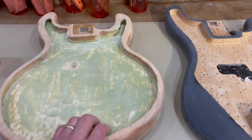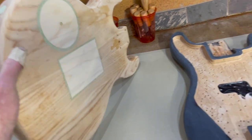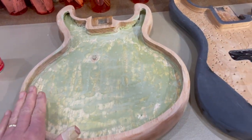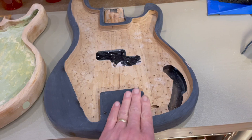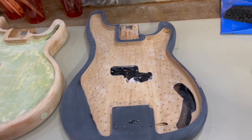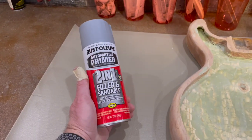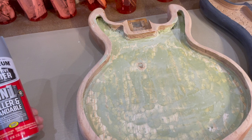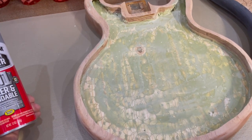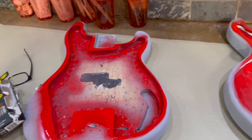After quite a bit of Bondo wood filler, I managed to fix the guitar body — filling spaces, old cavities, and gaps, then sanding it down pretty well and repairing nicks from the router. For the bass, I just sanded the body down to take the shine off so it'll take primer well. The next step is a Rust-Oleum sandable automotive primer on the bodies, mainly the backs, before I think about doing any epoxy. I also shot a bit of red spray paint under the ledge of the insert.